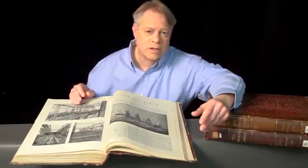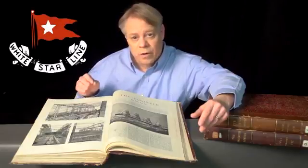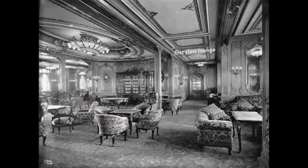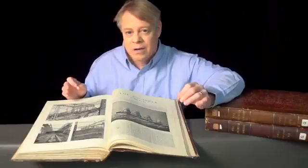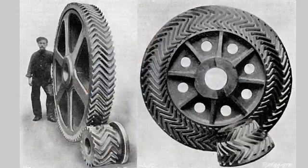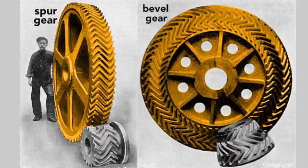Even with this powerful propulsion system, the Olympic-class ships were not the fastest at the time, which was intentional. The White Star Line decided to focus on comfort and luxury over speed. It's clear that the lavishly decorated rooms on the Olympic and Titanic certainly made the passage more enjoyable. But there were some hidden design choices that made these ships the pinnacle of comfort for all classes of service. The ships were steered using these helical gears. Each ship had two sets of both the spur gears and the beveled gears. These massive gears are nearly six feet across, made of solid steel, and each weigh thousands of pounds. Notice the herringbone pattern on the teeth — this pattern allowed a tight engagement of the teeth and resulted in reduced vibration transmitted to the rest of the ship. Altogether, the gearing on the Titanic weighed about seven and a half tons.